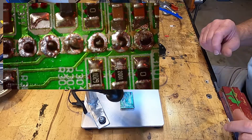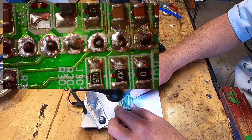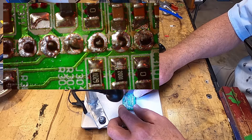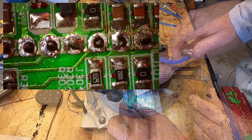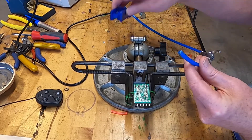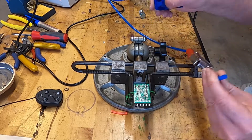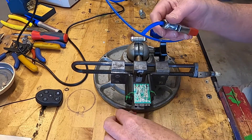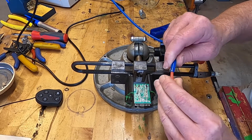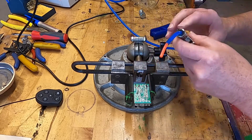I'm also seeing right there in the center, there's a little solder got sprayed around — yeah, there's another spot. I'm assuming it's supposed to be bridged or have contact with those capacitors. What we're going to try here: first I'm going to trim this back and get the gooky stuff out. We'll open that up maybe later and see how far up it penetrates. What we're going to do is put some four millimeter tubing inside the six — maybe that'll give us a finer tip to work with. Let's see how that works.